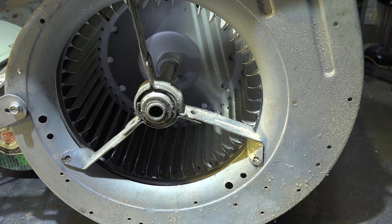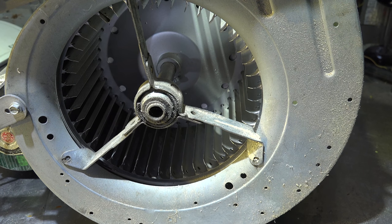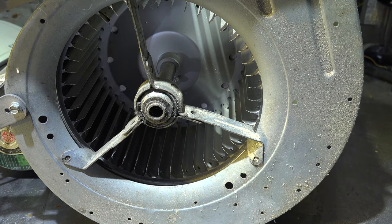If the furnace was over-fired when it was new it can do it, and there are some ductwork problems, but that's beyond the scope of this video. I'd be looking first at a plugged filter or plugged blower. I have videos on going further with some of this, and I'll have links at the end. Mostly what you're going to encounter is plugged filters or plugged blower wheels. Changing the filter is simple — that's the first thing you do if your limit switch kicks off.